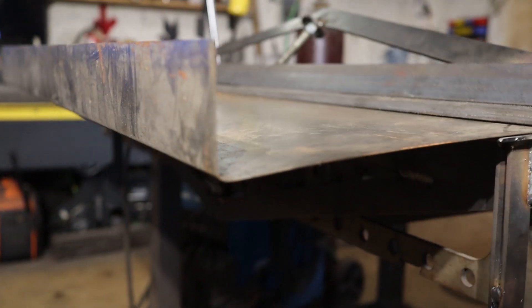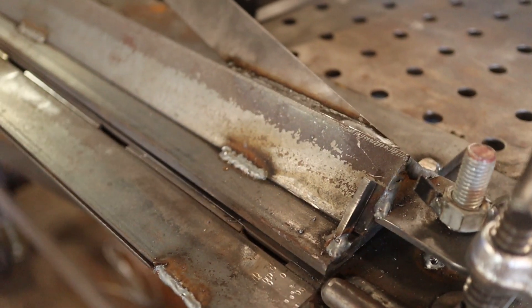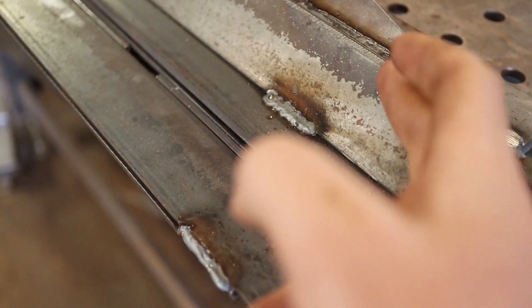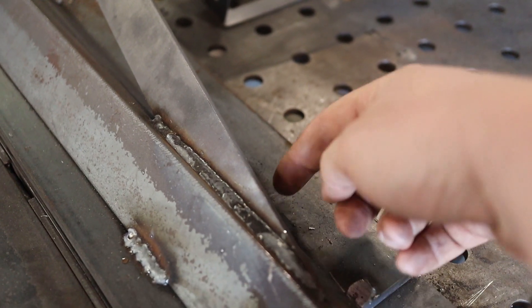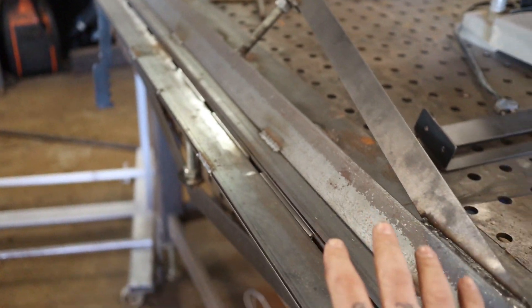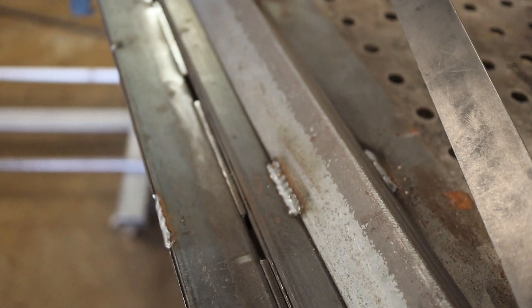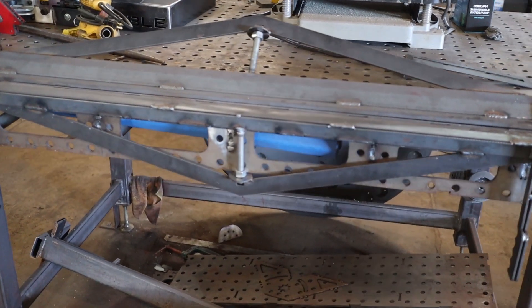Dude, that's pretty cool. Alright, you guys noticed the big bend radius we had before. I basically found out what was going on. This angle was a little bit too light, and this angle was a little bit too light — the wall thickness wasn't enough. So I went ahead and beefed up a little bit of material here, and actually moved this whole angle up closer to the leading edge. Originally I was going to try and cut notches in this and use it as a finger brake, but that whole concept doesn't work very well. So the plans on the website are a modified version of what you see here — it gets rid of this plate, steps this up to a quarter inch angle and this up to a quarter inch angle, and you end up getting a lot tighter radius bends.